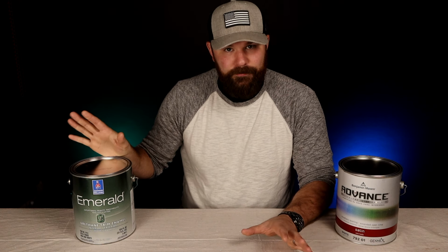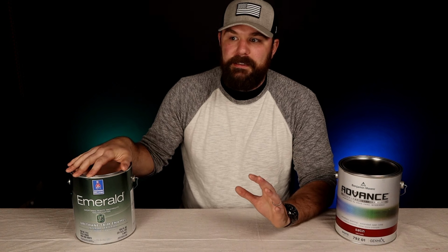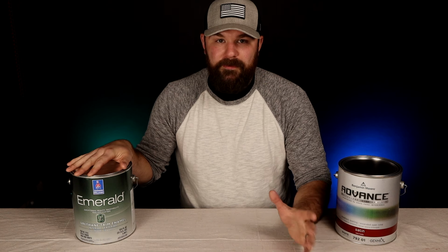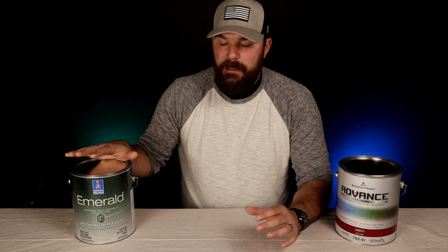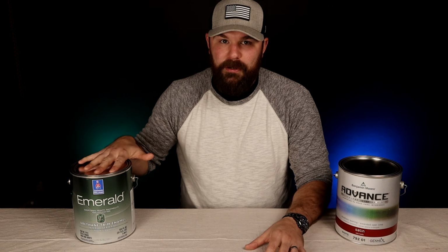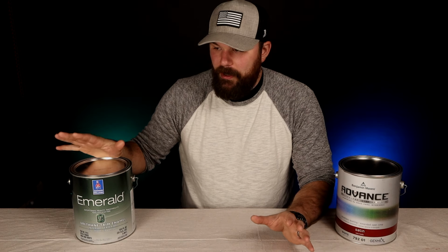Dry to touch time on Emerald is 2 hours. Pretty respectable. Nothing too crazy. And the recoat time is 4 hours. I find that to be a little bit long for this product, and it's not really what we experience on the job site. Most of the time we're moving things around with fans and getting things going. We've gotten our recoat times down to pretty close to 2 hours, and it always depends on the conditions of the room. But this product moves along pretty quick, and you can recoat way quicker than the 4 hour mark. So just be aware of that.